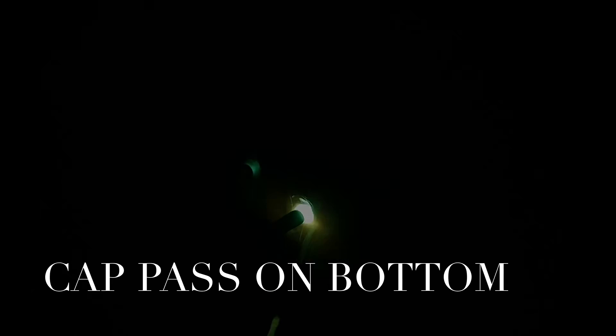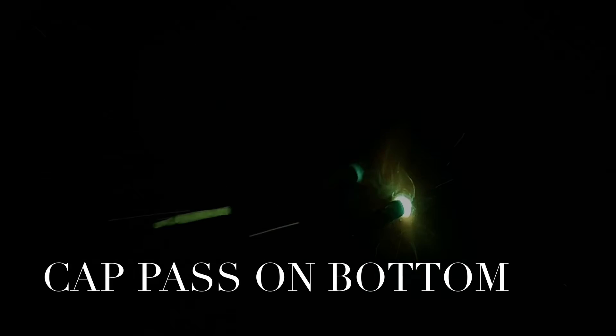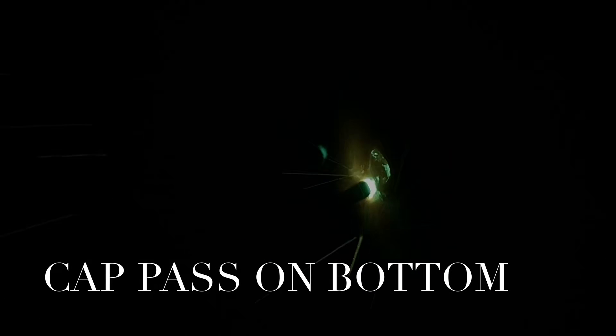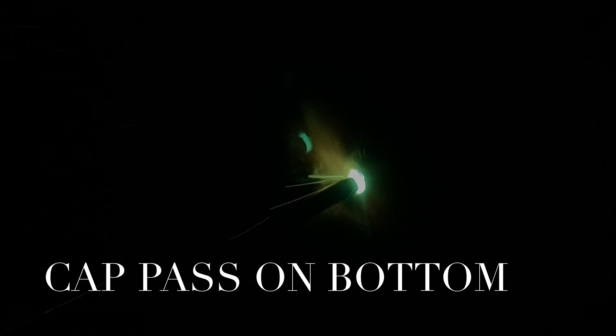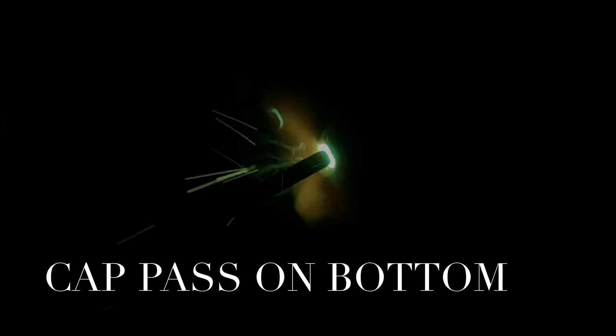Finally, last but not least, is the cap pass on the bottom. Once you come through dead man's curve, you've got to change up your manipulation a little bit for the bottom — it's just a semicircle, as you can see here. Coming up one bead wall into the puddle, back down the other side — like a half moon or semicircle manipulation. That's just helping you fight against gravity and control that puddle as you're going into the bottom for the tie-in. We encourage everybody to try different techniques. Here's the finished product — cap, root — everything looks really good. Hope you enjoy our videos. Please subscribe and we'll see you next time. Merry Christmas.